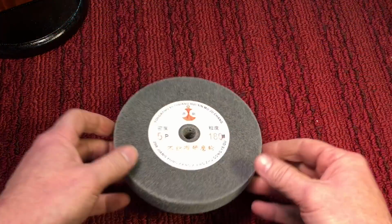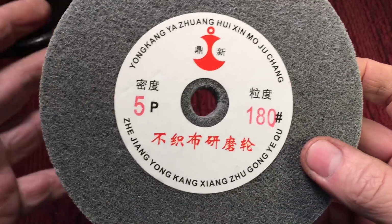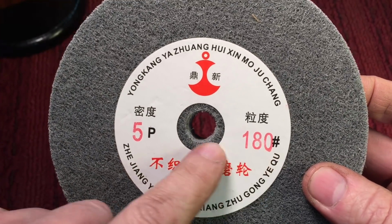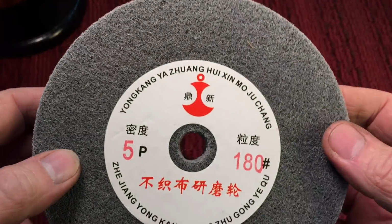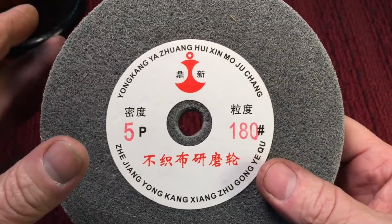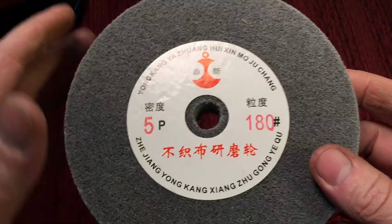You got to get one of these. Let me show you. Now, like I said, Joe was the first one to actually try this thing out, and this one here, you get them on Amazon. I'll put the link in the description, and it comes in different grits. I take it this is the grit here, 180. This is a 1-inch wide. Now, they also sell a 2-inch wide. I wouldn't recommend the 2-inch first because a lot of times a thinner wheel is easier to work with. But it's a fibrous wheel, and it works really good.